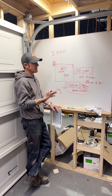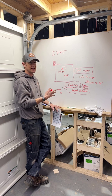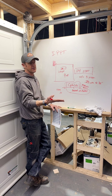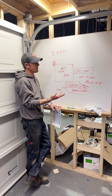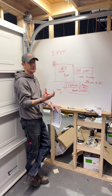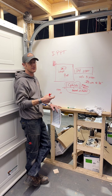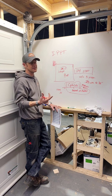The IPPT works for folks that are stocking regular springs with a known IPPT — now we're just matching and playing it out. You find out a doorway's dimensions, the drum you're using, the height, and the track configuration. You input that to find the IPPT, and then it's fairly simplistic math to match it up. The only thing to consider is the spring wire and the amount of metal — does that hit a 10,000 life cycle, more, or less? If it's short, maybe that's a temp fix to get that door moving until you can come back with the correct spring that has 10,000 cycle life or more.